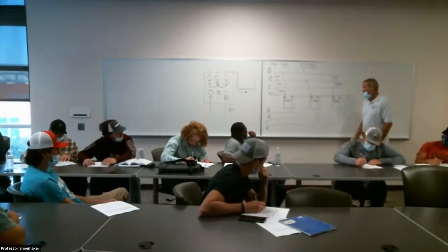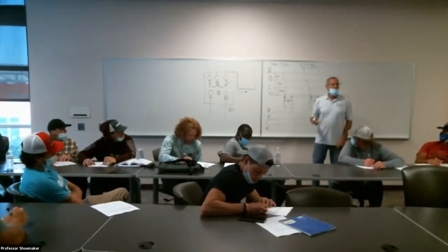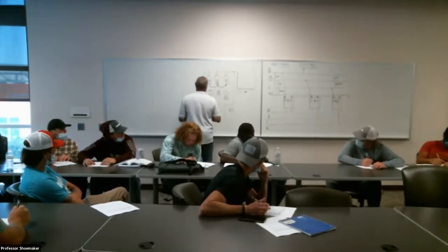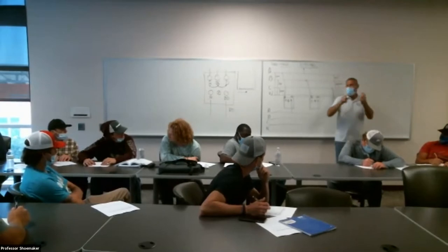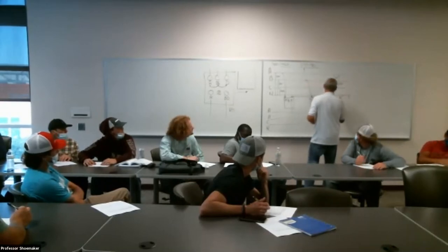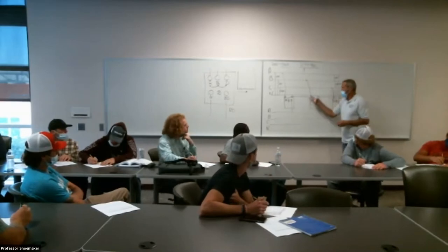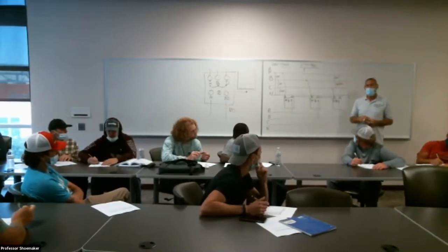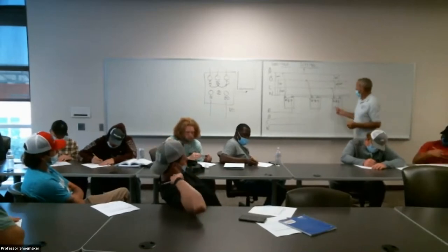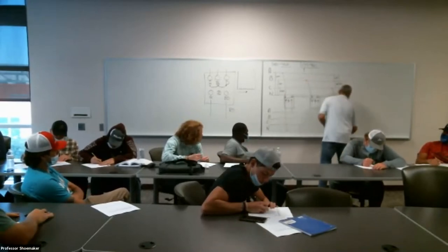So I made contact with A phase, B phase, and C phase. Everything's rocking good so far. All right. What do I need to have a complete path for current flow? On a regular single-phase transformer, you have a hot wire coming in, and the other side goes to ground. Good deal. So I'm going to come from here to here to here, my class. What do we call that wire that spans and goes across all three transformers, or sometimes two? Tie-in bus. All right, so I've made connection on the same bushing, the left-hand bushing every time, and I need a path to neutral and thus ground.